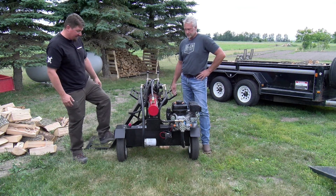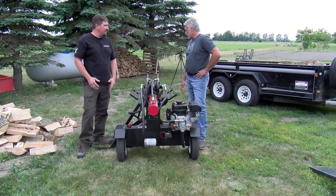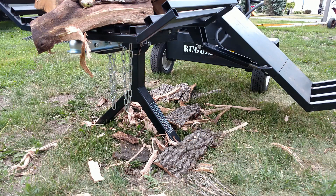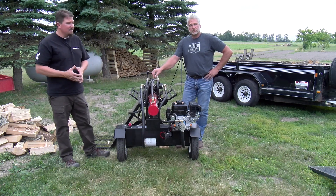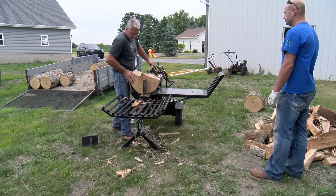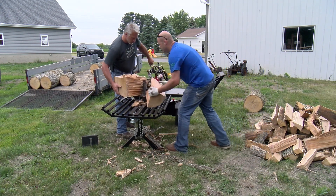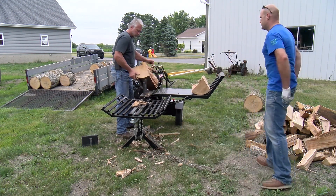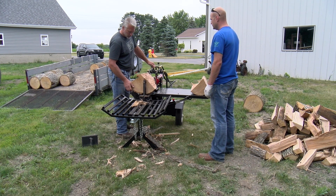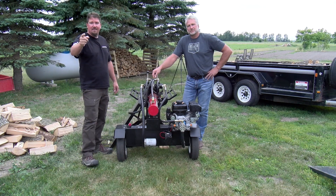Other than that, this seems like a good unit. It comes with fenders, smaller tires, a two-inch ball — pretty much a decent unit for the price. It's very stable with the tripod-style jack on the front versus other ones that are just a single leg. There are a lot of warning stickers on here — notably, you're not supposed to travel with this unit over 45 miles an hour. If you're looking for something bigger, you can also look at the larger models they have. Guys, we'll show you how this thing works — watch some of this going through and see if it's something for you. Leave a comment below, give us a like, subscribe to our channel, and follow us on Instagram and Facebook. Have a great day.